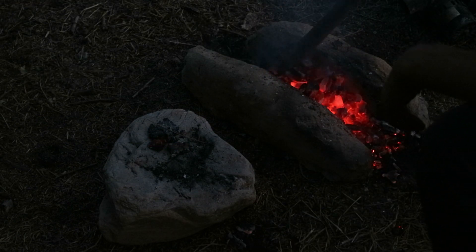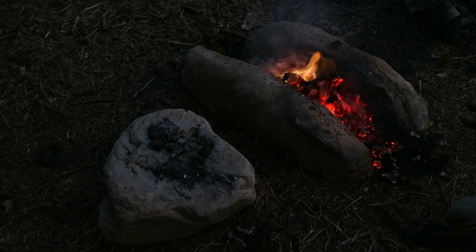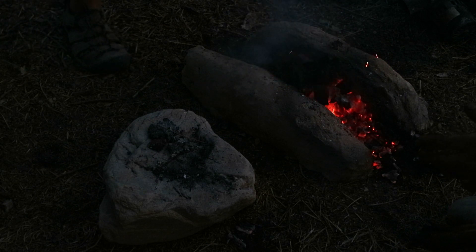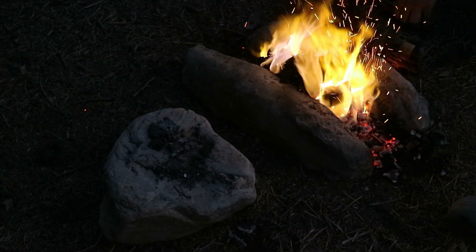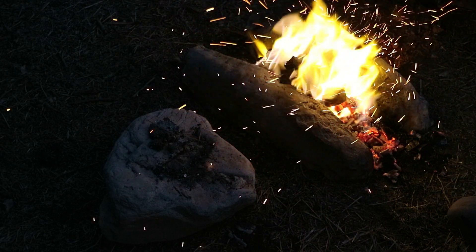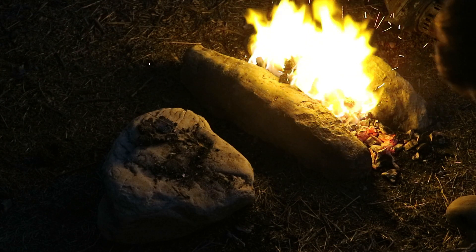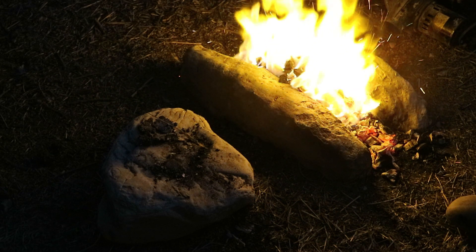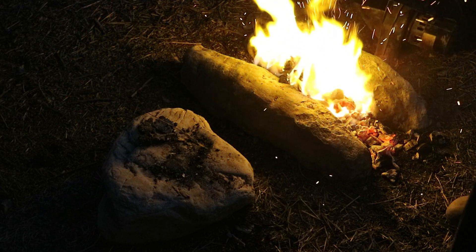The Japanese smiths that I've seen make samurai swords — what they'll do is they'll layer these on top of a metal spatula, then end up welding them to the spatula when they put it in the fire. That option I don't want to do because I don't want to introduce foreign metal — I'd like to do this pure. But that means I don't know how to layer those stacks; there's got to be a way. Okay, I think I've got yellow in there. You think we're good? Yep, all right.